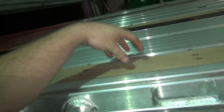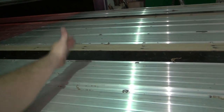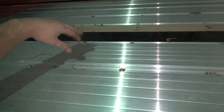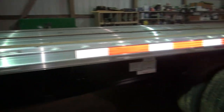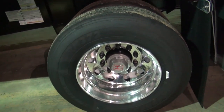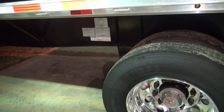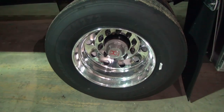Without the coil package is probably why this trailer was a little cheaper, and that's roughly how much extra a coil package adds. In the center of a trailer with a coil package, your cross members on the bottom will be on closer centers — normally they're on one-foot centers, but in the coil package area they're closer together in a four-foot section. That, plus the pull-out chain for securing the coil. Not having it also made this trailer a couple hundred pounds lighter, which actually benefits me more than the coil package would. It does have grease hubs.